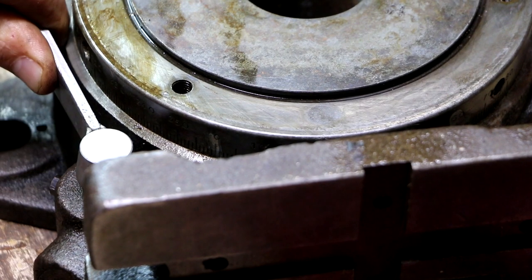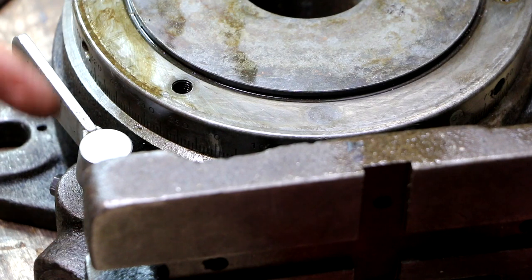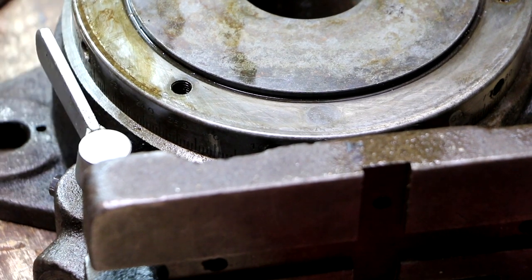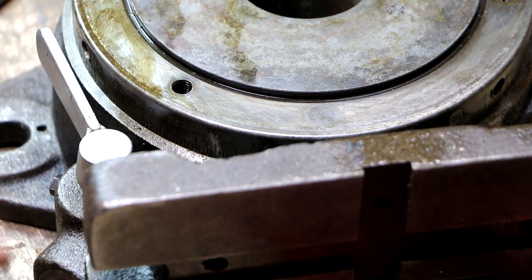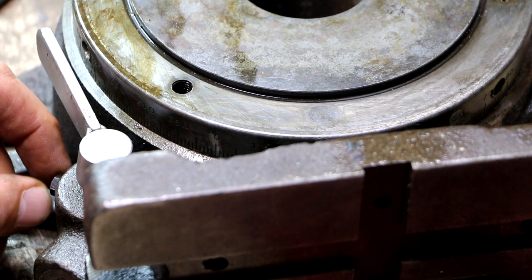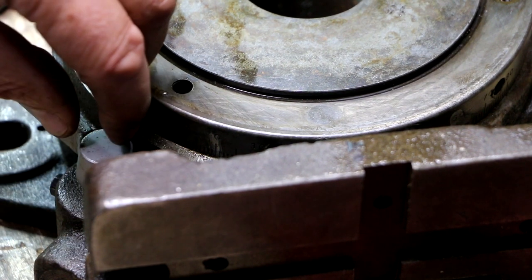All right, so see, I can't turn this. If I keep turning this, I think the rack and pinion will allow this to back all the way out, but I can't turn this any further. But I think the idea is that we loosen this jam nut, and I think if we back this Allen screw out, the set screw out, I think this whole thing will slide right out of here.